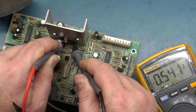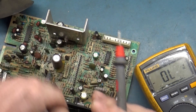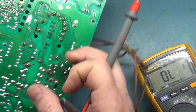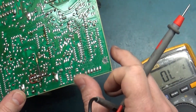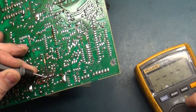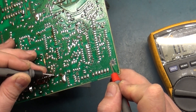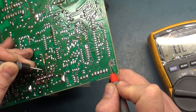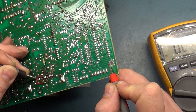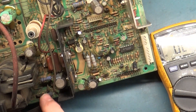We get 0.5 volt drop this way, and we should not get a reading the opposite direction — and we do not. So our vertical IC does not appear to be shorted. Let's verify that no pins ring to ground that shouldn't. There's only one pin that should ring to ground — I think it's this one. Going to continuity: that's not the right pin. It's that one. Pin four — that's supposed to be ground. So we don't have a shorted IC, a bad D603, a bad D302, or a bad R303.